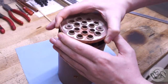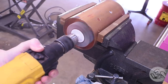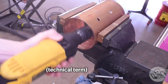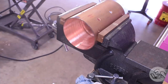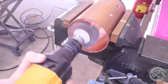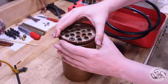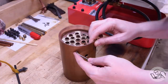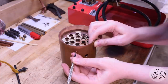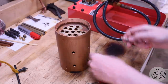So the core slides in there, but you really need a little better clearance than this. It's kind of a snug fit. Silver solder needs more of a gap than that, so that's the first job here. I'm going to start with the drill and a sanding flap drum thing, and I'm just going to clean up the inside of this. This might be too slow for actually clearancing the copper, but I have to do a cleaning on it anyway for the silver solder. And that does fit better, so I continued with that all the way down. I think that's still a little snug though, so let's get out the feeler and see how much more work there is to do. Every test fit requires lining up the stud holes and installing the studs. This stud system does work quite well, although I think next time I might just use rivets that are not actually peened over, just to hold things in place for soldering and other test setups like this.